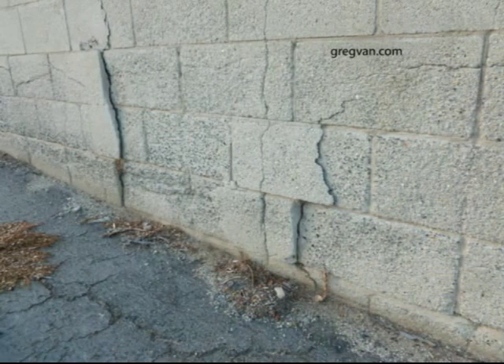Here's an example of what a lot of moisture can do to a block wall. I'm not saying 100% this is all due to moisture, but there's a good chance that moisture has a lot more to do with it than anything else. Even if these blocks could have been manufactured incorrectly — why aren't the rest of the blocks doing the same thing? There's got to be a problem. These are the problems you're going to see when a retaining wall is built incorrectly and too many plants are up there being watered heavily.